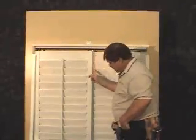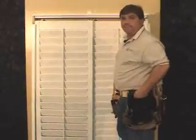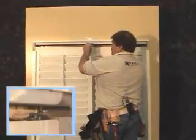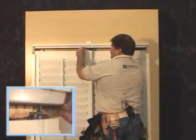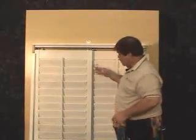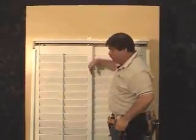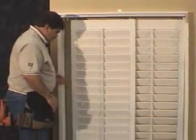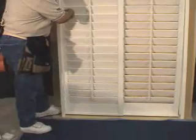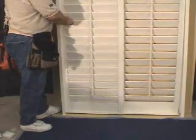Each of the corners on the left and on the right are up against the frames. We can now look at how uneven the panels are — let's fix that. The way to fix that would be by using the track wrench supplied in your hardware box. Simply place the track wrench on the screw and adjust. The adjustment can be made up or down on the panel until the panels are even vertically. Now that we have our panels even in the middle vertically, we can bring the legs to the panel.